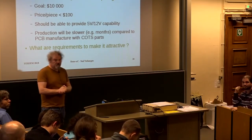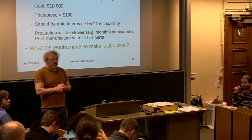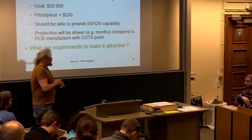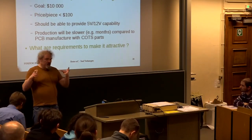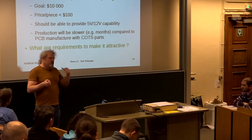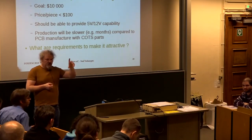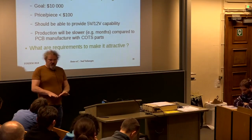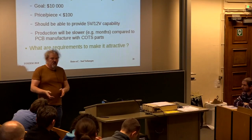Question: all these chips have different buses in their original form — will you provide those buses as well? Currently I chose the microcontroller approach so you just have I/O and not a memory bus on the output. It should be no problem to make a chip that exposes the 6502 bus in 6502 mode and the Z80 bus in Z80 mode. But I want to reduce risk — I want to limit the RTL code I write to reduce the chance of bugs in the chip, since you can't fix a hardware bug without ordering a new run.